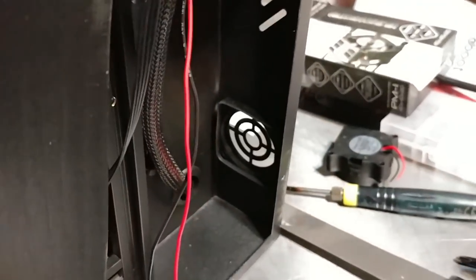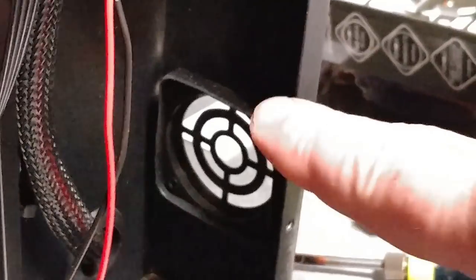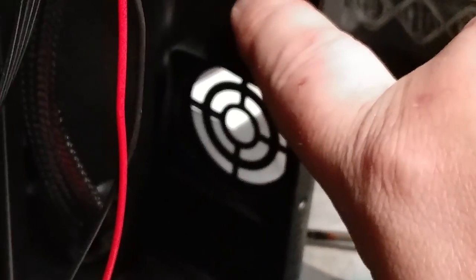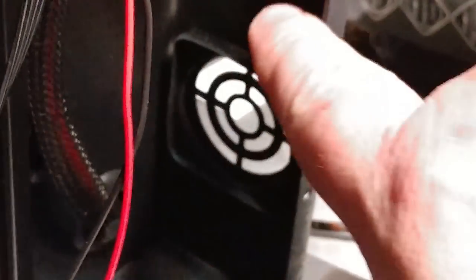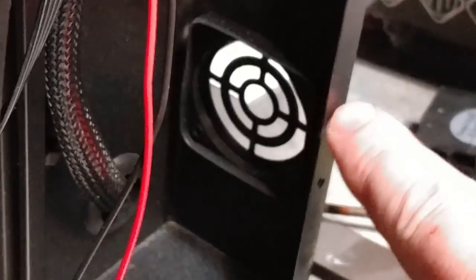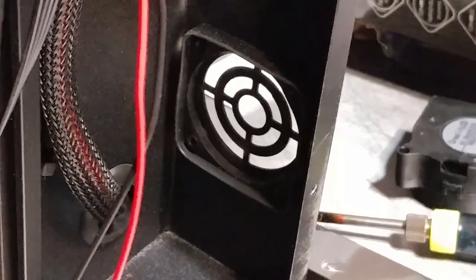It comes with this little rubber boot that does two things: one, it makes sure all the air goes out, because there's actually a physical gap between the fan and the frame which is bad. Creality, when you redo this - the fan should actually touch the frame and you should have a piece of cushioning between the fan and the frame so that vibration noise from the fan doesn't resonate on the housing, and that also keeps air from going around the hole instead of through it. This rubber boot will do that.